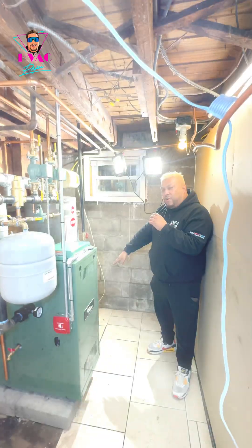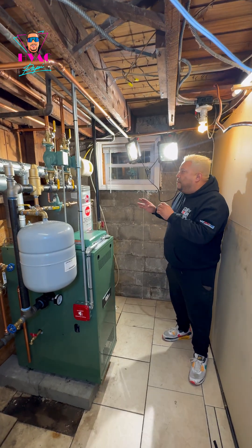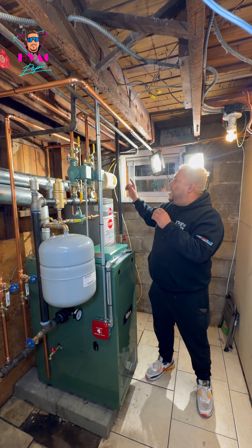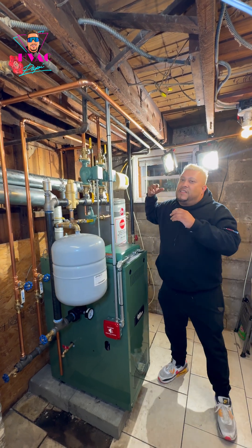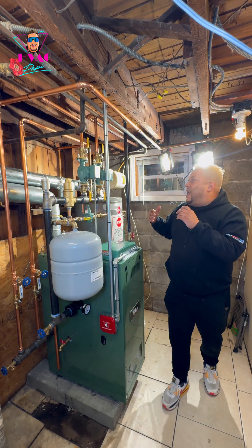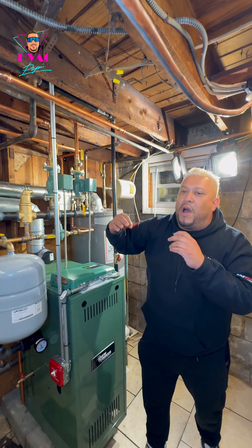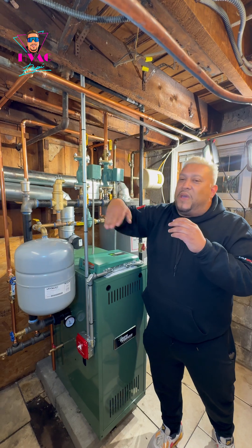They shimmed up the hot water tank because it's a little bit cockeyed. It's kind of hard to see on the camera, but we had an issue with the exhaust pipe — it was corroded from the bottom, so we changed the exhaust pipe at no extra charge. We also put an air diverter right over here. They had the mushroom on here but we took it out, because you don't think about carbon monoxide. People don't think about safety. There was a downward pitch, and we can't have that. Right now we have a slight upward pitch towards the chimney, which is what we want.